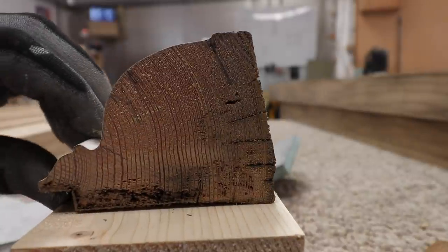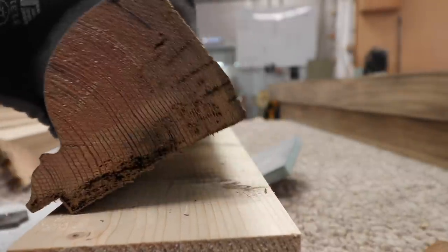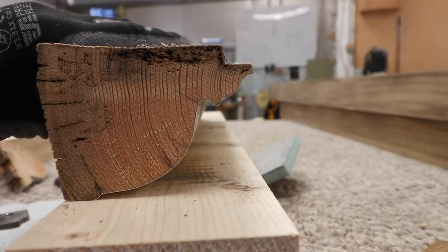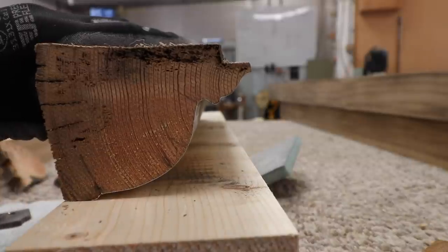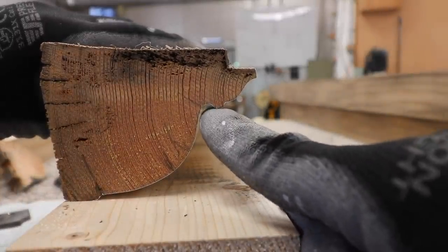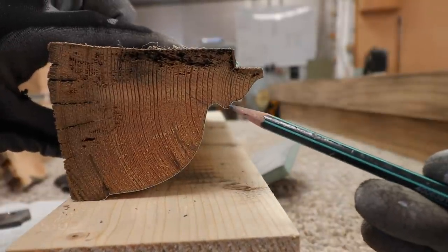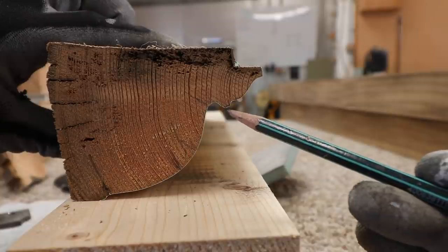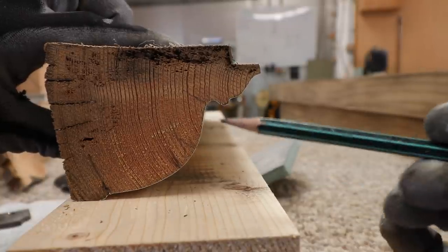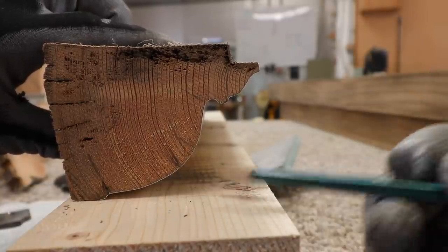without risking the timber tipping into the fences. So I think I'm going to machine like this for a start, and I will rebate out to the height of this little bead here. So to that little nib there, rebate out to pretty much that height through to there, and take that out in one cut. So leave us with a nice wide flat section here.